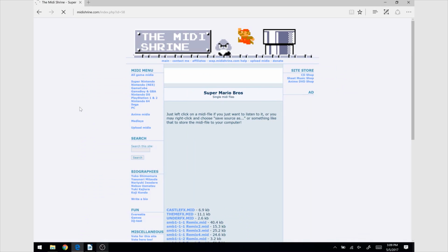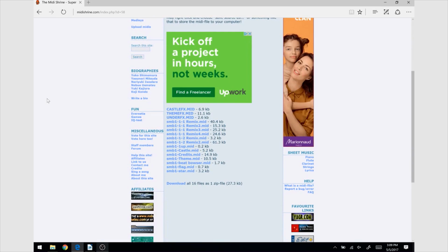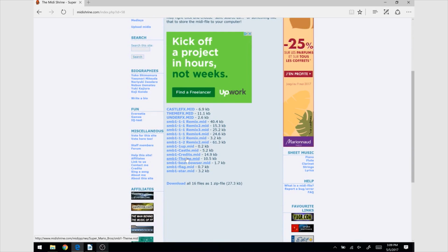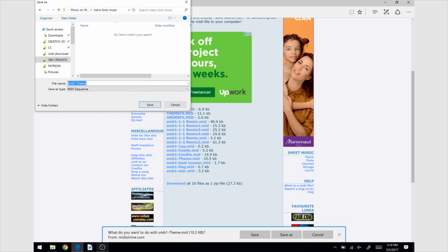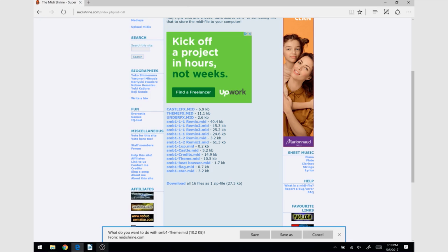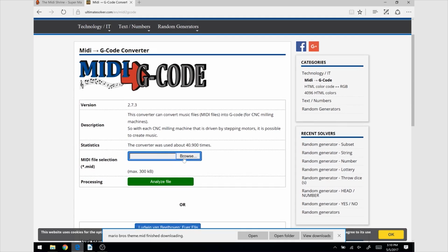I'm going to use some Mario Bros music because I'm very geek and also because I already knew there were many MIDI versions of Mario Bros video games music. Know that you can find almost any song in MIDI format, you just need to search for the song or video game soundtrack plus the word MIDI. Once we've got the MIDI file, we need to go to the MIDI to Gcode converter page. I've left a link in the description and this online converter is literally the only thing you need to use.